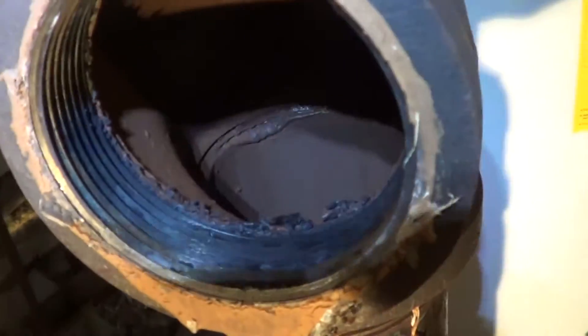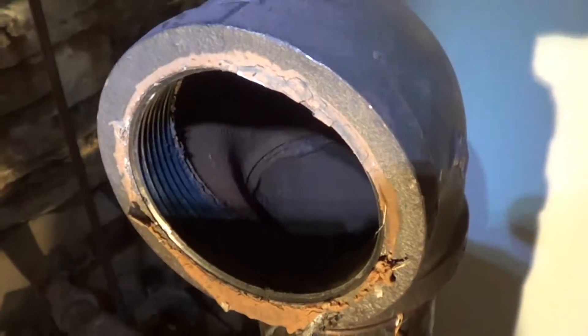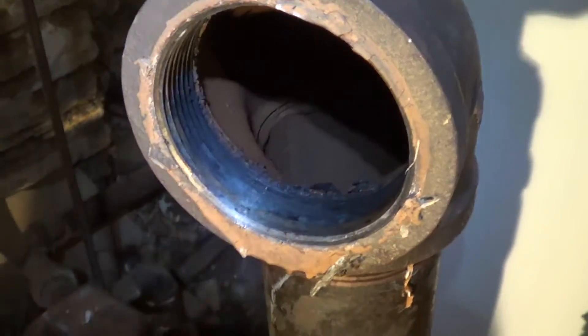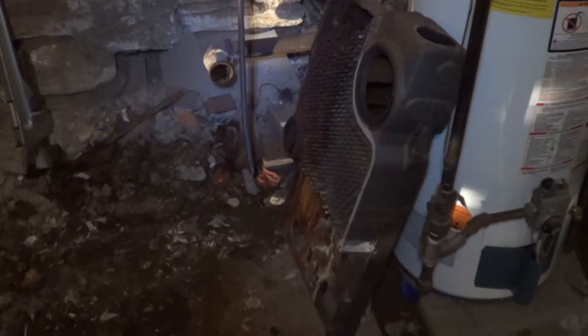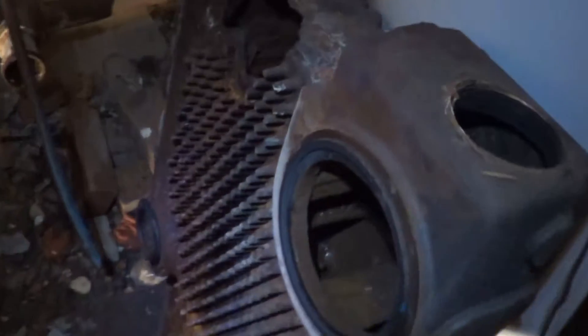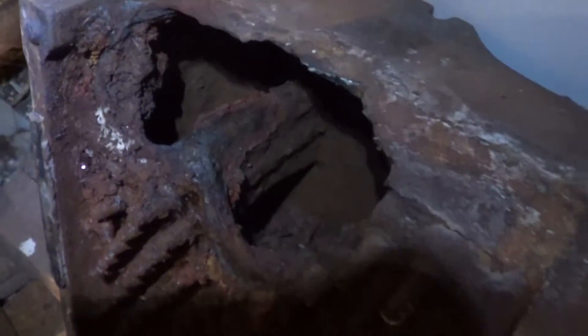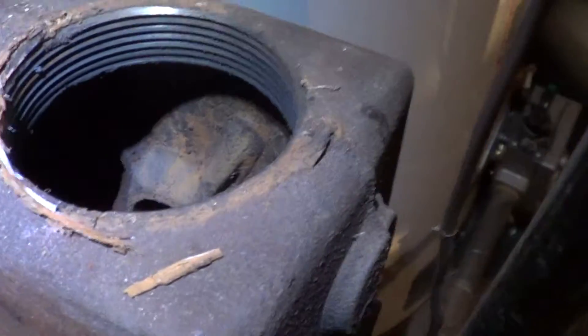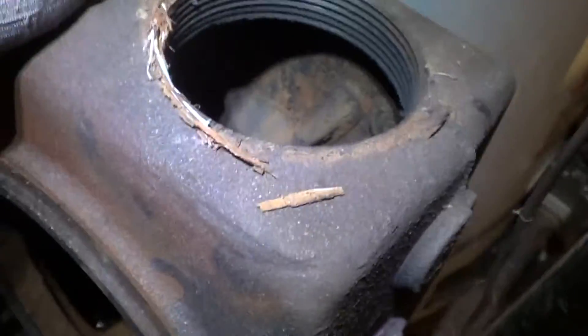And then the steam pipe is actually in pretty good shape, because the steam is quite pure. This was more of a water quality issue, which caused the cast iron to rot out at 14 years. We got the heat exchanger broke down here. Look inside — there's where we had the major corrosion. I was starting to see spots that were starting to do that same thing.